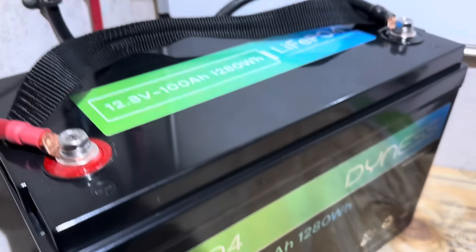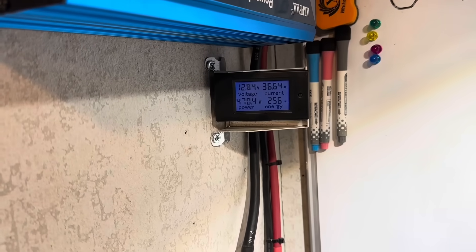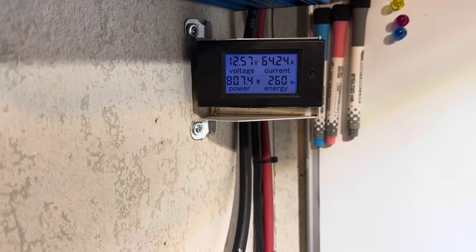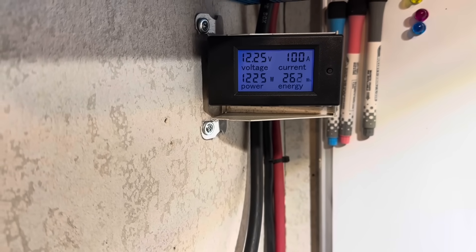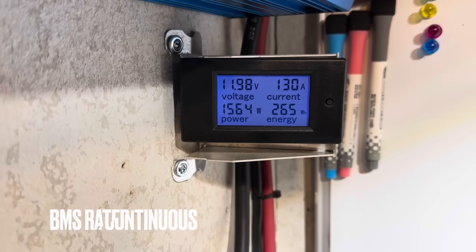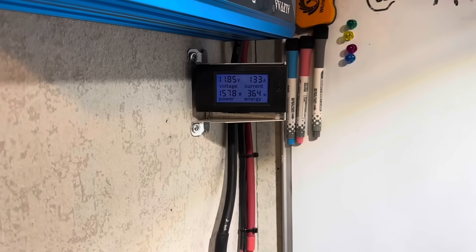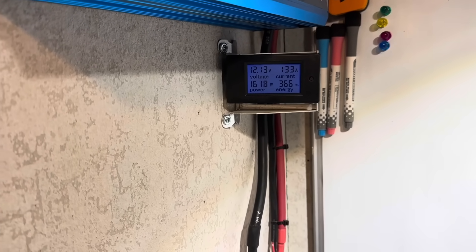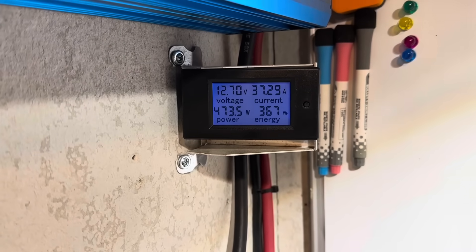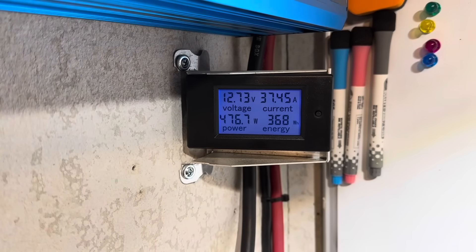While this Dyness battery is fresh, I'm going to hit it with an increased load for roughly 100 watt hours to see what the BMS can handle. Adding another load now — it's ramping up, it's another charger. I'm going to hit this battery for 100 watt hours at a high current draw to see the robustness of the BMS design. We're at 130 amps and 265 watt hours, so I'll run it to 365 or until the BMS trips out. Coming up on the 100 watt hour mark — removing the additional load back to the original charger load. It held the 130 amps for that period of time, no problem at all. Make note: if I lose an amp hour or two, that would burn off as heat during that hard pull.